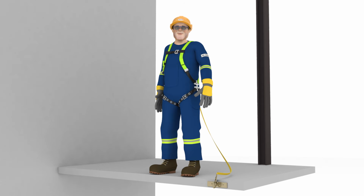So, if tying off at the same height as your D-ring gives you a free fall of the length of your lanyard, what happens when you tie off below your D-ring? Well, we've seen that the lower we tie off, the higher our free fall distance becomes, and we know that if we tie off at the same height as our D-ring, the free fall will be the length of our lanyard. For every foot we tie off below our D-ring, we are adding 1 foot of free fall to our lanyard length. If Abel were to fall from this position, he would fall the 5 feet to be level with the anchor and continue free falling the entire lanyard length of 6 feet until the lanyard is hanging straight down from the anchor and is pulled tight. So, essentially, you must add to the lanyard length the distance that the anchor is below your D-ring.